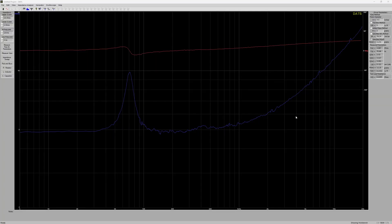Moving on from the montage to DATS — I believe the new method of securing the coil with epoxy versus CA glue caused an increase in overall moving mass, as the new speaker is about 1 gram heavier than version 18 when it was built with lighter components. It also has an FS of 70 Hz versus the 50 Hz of version 18. The efficiency of version 19 has increased though, producing 78 dB at 1 watt/1 meter over the 77 dB that version 18 had. I wound this coil closer to 5 ohms instead of 6 ohms like the last driver, in hopes of getting a bit more power from the amplifier to help drive the passive radiator. We can see this motor is still performing as expected with the nice resistance spike at the resonant peak.